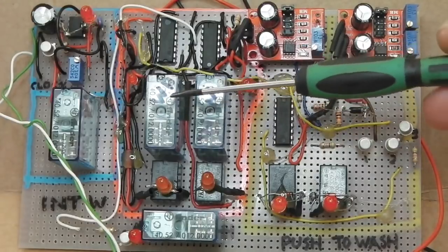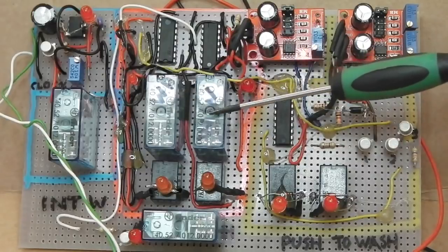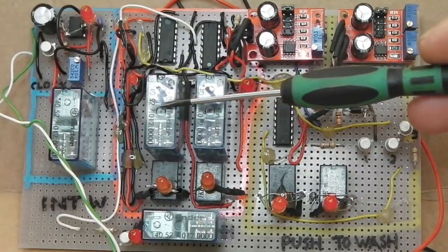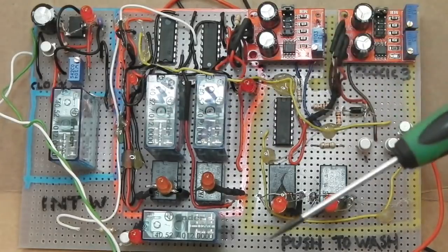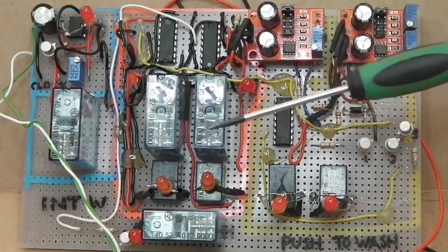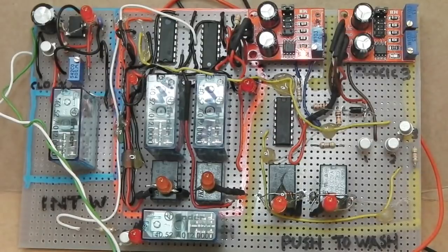Activates the wiper relay only, not that's a wash wipe relay, that's the wiper only relay, activates that relay for post wash wipe. So it's post PWW, post wash wipe, and that's all that does. Then it's cancelled out. I'll show you working now by connecting the 12 volt feed to it.